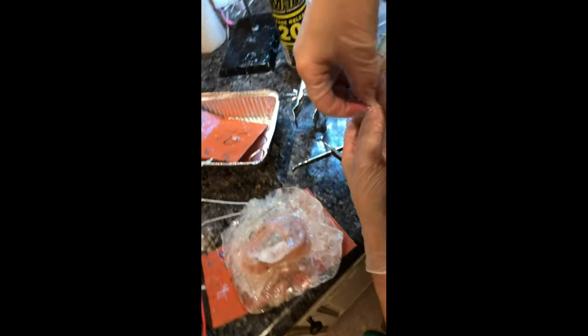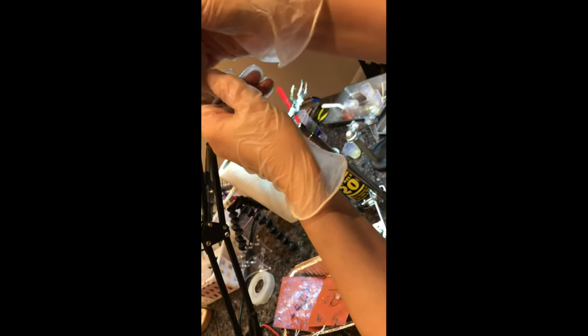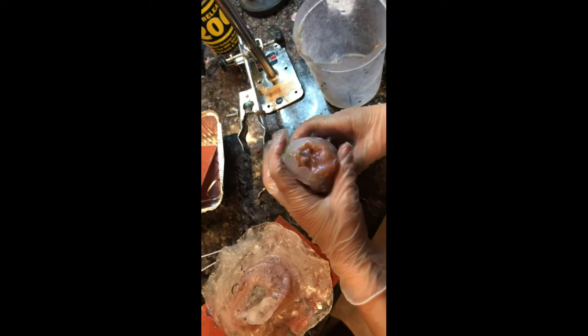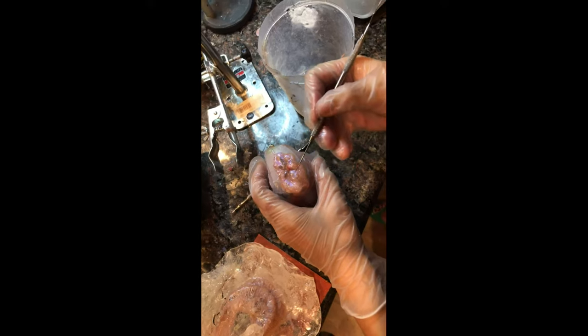Okay. There's one there. Just squeeze it in by hand. Yeah, that stopped it, look. See? Okay, so now I'll just quickly check all the way around to make sure there's no air bubbles, which is really hard to see now that the mold has gone a milky colour. If I could inject more, I would. But let's see. Pop that. Bubble, pop, come on. Otherwise I'll end up with a porosity in the join. Okay, that'll do.